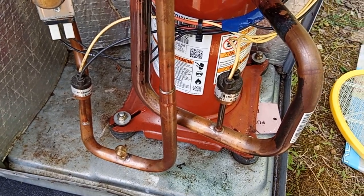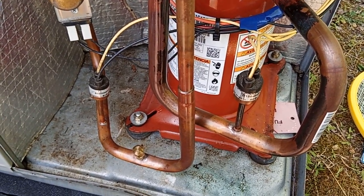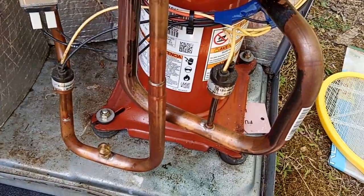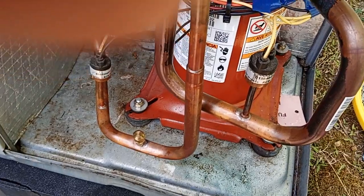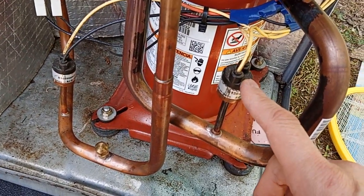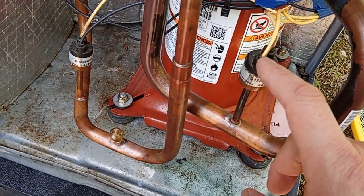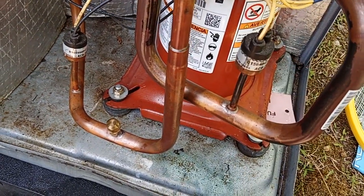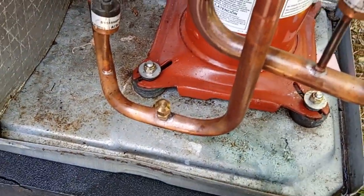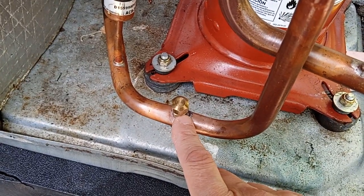The system would heat okay, but this year the cool call terminates in about 10 seconds. The compressor shuts off, and the outdoor fan shuts off because that low side cutout opens. 24 volts on one side, not on the other. So that's the failure. And what's been traced down to is two things with this high side Schrader access valve